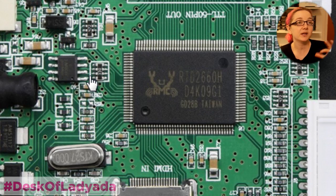We've even done this for other chips, like the VLSI VS1000, which is an Ogg Vorbis / Wave microcontroller plus DSP. The code and file system are stored on external SPI flash. So when we're in production, there is a bootloader on the chip, but we skip the bootloader and just burn the chip directly to the SPI flash.